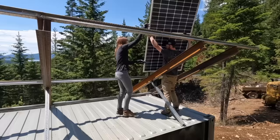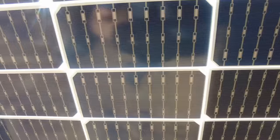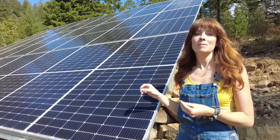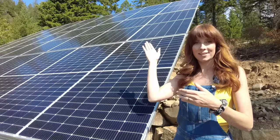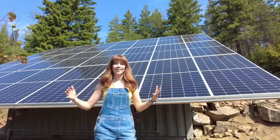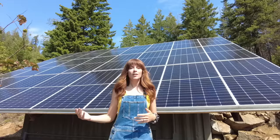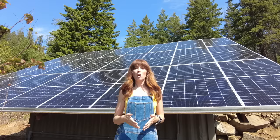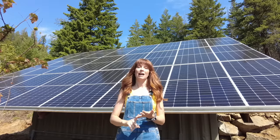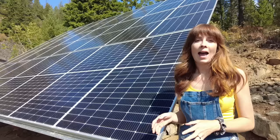We installed 24 solar panels from Santan Solar — they are 445-watt bifacial panels, which means they capture light from both the front and the back. We're really hoping that in winter this helps absorb some heat and melt the snow off the panels. The tilting array should also help shed snow by getting them into a really steep winter angle. Living as far north as we do, we really needed to think about our system in winter because we have such limited daylight. By having this large of an array, even with limited daylight and cloud cover, we're hoping to capture enough energy to minimize how much we need to run a generator. Santan Solar is a solar wholesaler, and at $230 each, the total cost for 24 panels was $5,520.